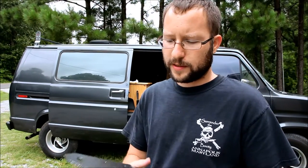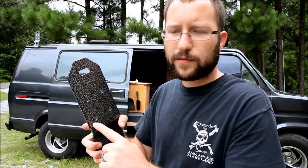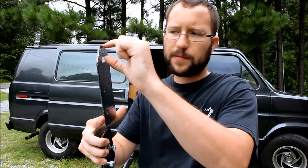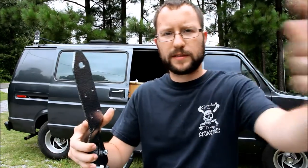What I'm going to do is weld my rack right to this. If you can see here, my bottom rail is going to go here, I'm going to have a top rail here, and it's just going to be a big cage on the top of the van. So I'm going to go ahead and put these on, measure everything out, and then cut the rest of my steel.